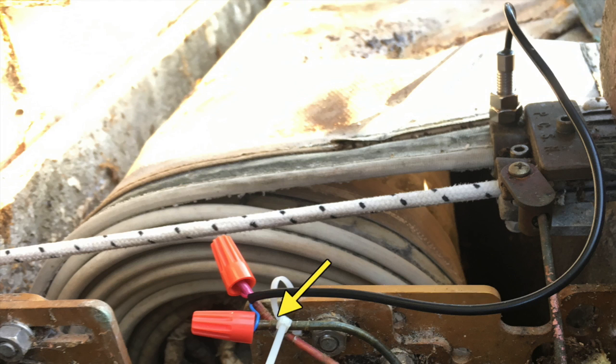Right at the edge of the pool cover is a sensor, with the same set of wires — black and red — coming in. I checked it for continuity and indeed it was the same set of wires. I then pulled the sensor out, which is a bit of a trick. The sensor can be mounted on top or underneath — it was originally underneath. This is the new one shown in the picture.